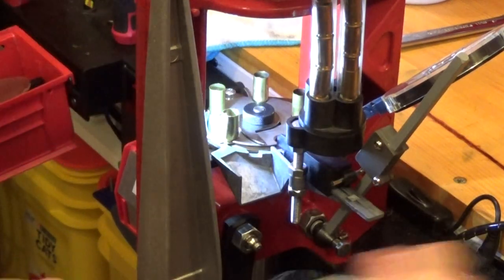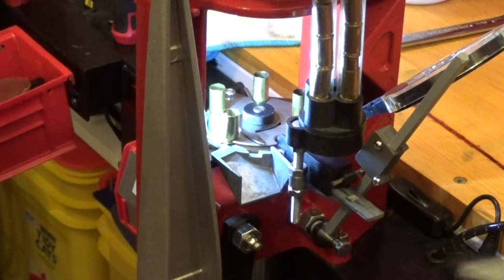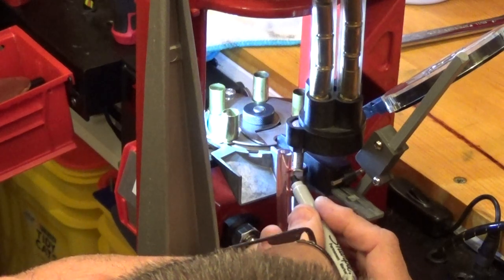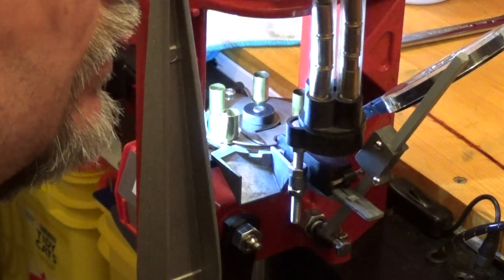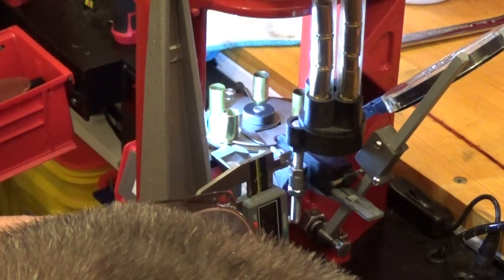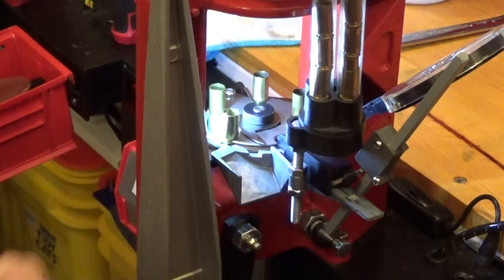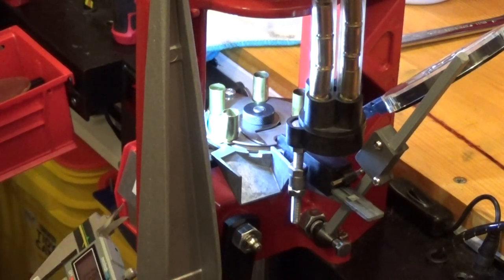And what I try to do, got another marker here, and I'd like to try to go and put tubing in between, and then next time I take it off or something's going on, I know exactly what my reference point is. And let's see, where's my caliper? Okay, on a 40 caliber, the distance between the top nut and the bottom nut that sits right on the hole is 0.456, and that's in inches.